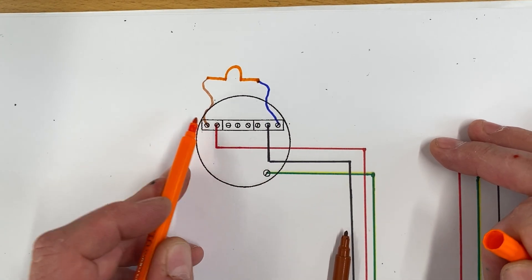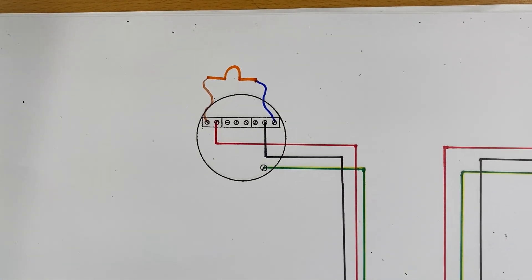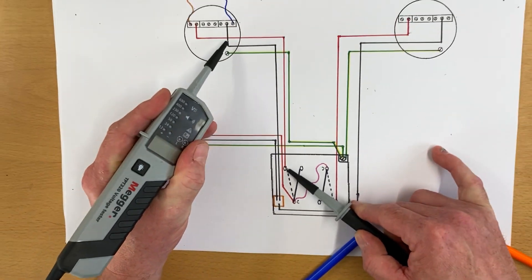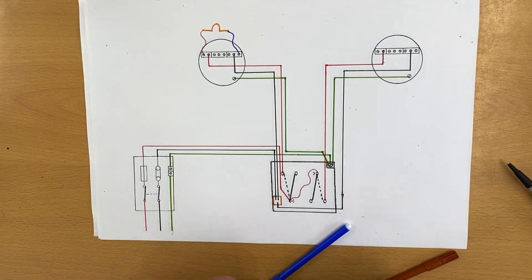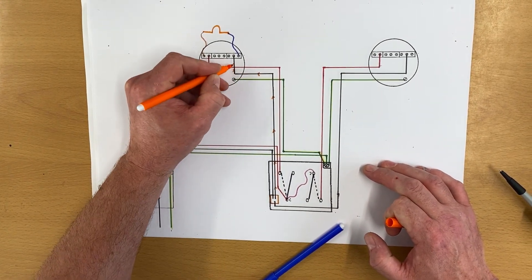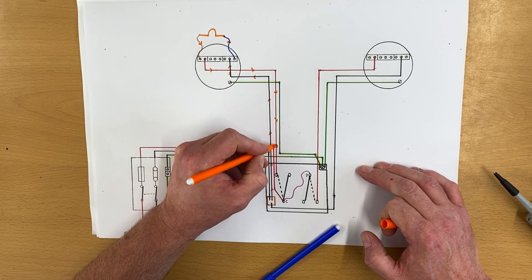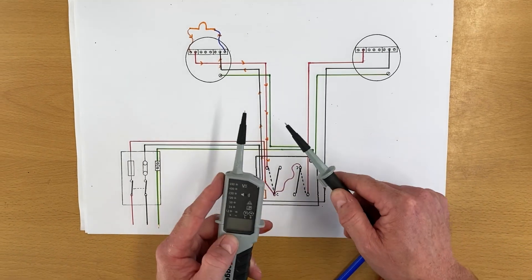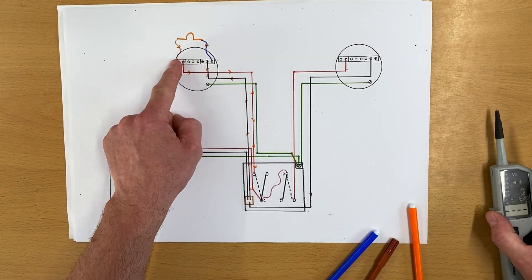The lamp is connected across the neutral and switching line. We left those in circuit — something we don't do in a college environment when doing this style of testing. So when we're at our switch testing between neutral and switching line, we've actually got the connection via the lamp that comes back round and gives us that continuity buzz. The path comes from our neutral, goes through the lamp, and connects to our switching line conductor — hence it's beeping. No voltage; it was isolated. We had no volts between neutral and switching line, but we certainly got a beep because the lamp was in circuit completing the connection.